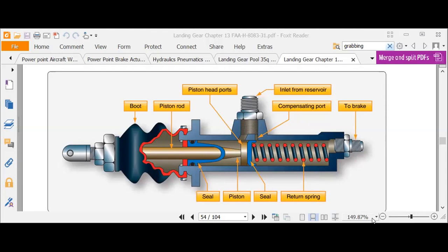You might have to take a wrench and crack a line. Or they may give you some way to bleed that off. Once you pull that bottle, like the bleeder valve on the calipers. Yep, that would work. I'd just probably take a wrench, crack the nut, and let it bleed down. Okay.